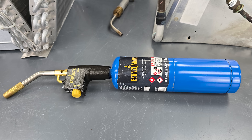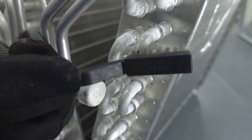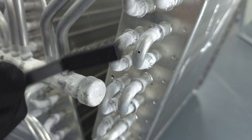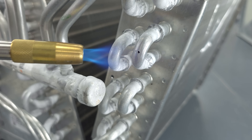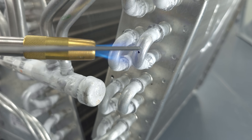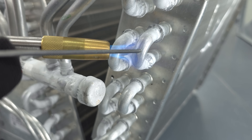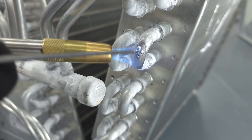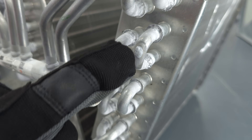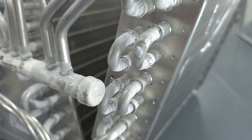In this example, I'm going to use a propane torch with the all-in-one rod. We already have to fix this little spot right here, so we're going to use our stainless steel brush in order to clean this up. Once you do get it to start to melt, you can move the torch around it a little bit to just try to spread it out — and that's how you do it.